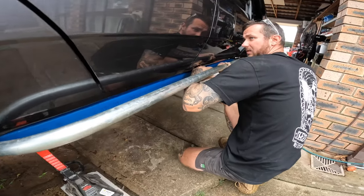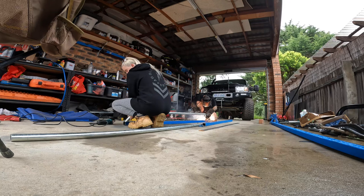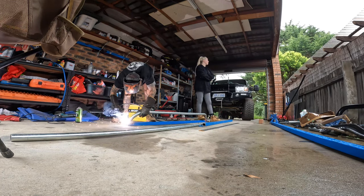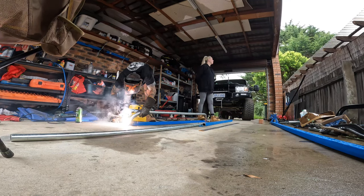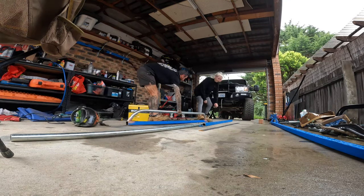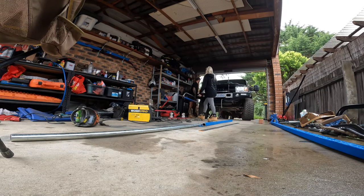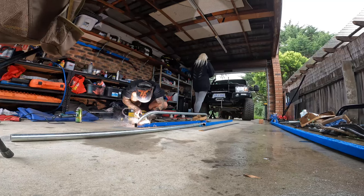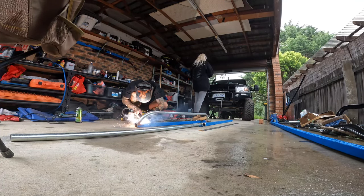Which is nice — and you can still open your door. I was just tacking each end to make sure I didn't have to cut complete welds back off if it didn't suit the set degrees I had measured for. As you can see I'm carrying it to the car just to make sure it was going to be right, tested it with the door, and I could still open it. Now I'm going to do full passes and completely weld this on.